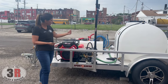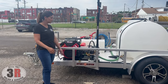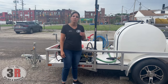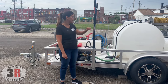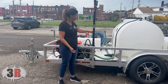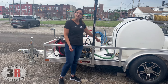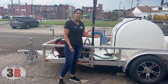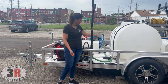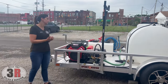We have a filter system going to the pressure washer as well. Lots of filters means keeping all of these pumps clean, and it's super easy to clean them out. We put ball valves in front of all of them so you don't have to empty your tank. If you feel like you're getting low flow, you can just turn the ball valve to shut off the water flow from the tank, unscrew your filter, check for any debris, get it cleaned out, put it back in, and open up that valve again and it'll push the water right through — quick, easy filter cleanouts.